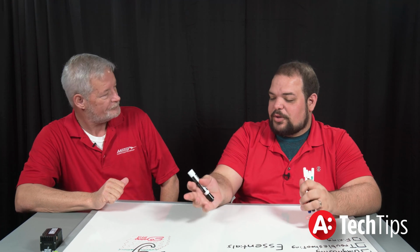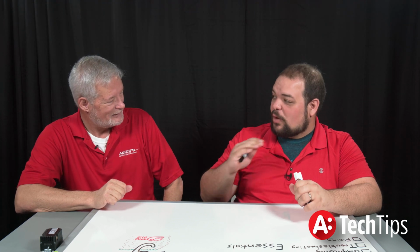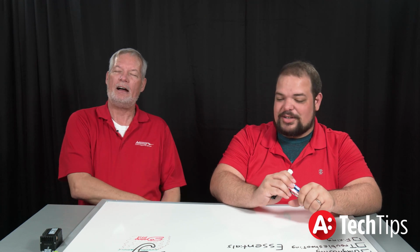I mean, when you look at what a good grounding setup is, 12 gauge, 12 gauge copper, well, if you're trying to run that much grounding over the braid on a piece of coax, it's definitely not enough, and you're going to cause some serious troubles.